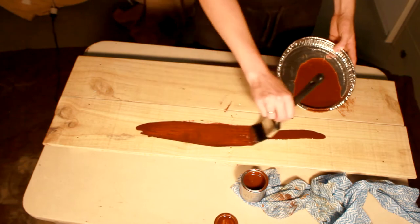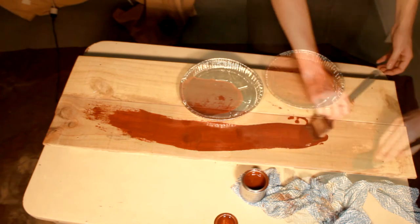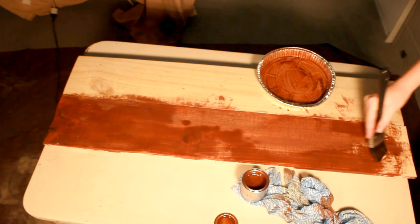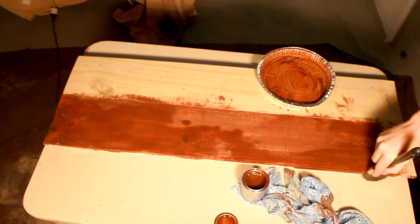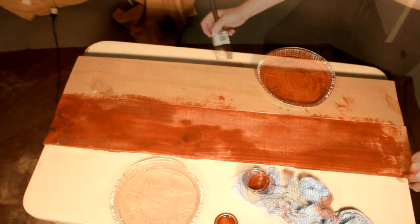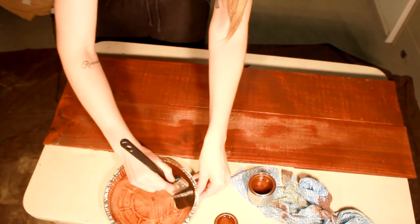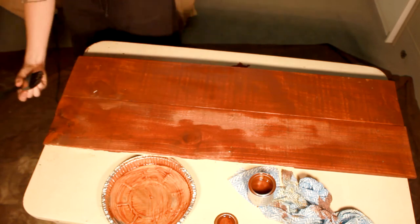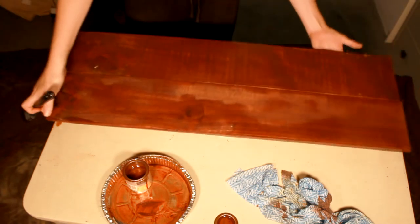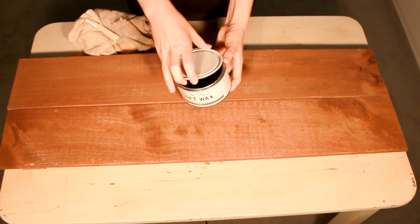You'll at least need to oil the wood, but if you want to stain it, now's the time. These dollar store brushes are complete crap, so I applied the stain quite liberally. Just make sure you get all the edges, take your time. I only did one coat and I was happy with the level of color. Don't forget the undersides either.